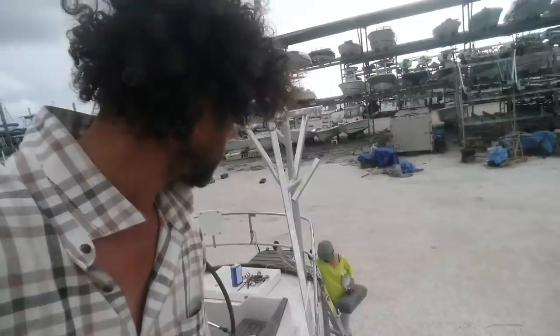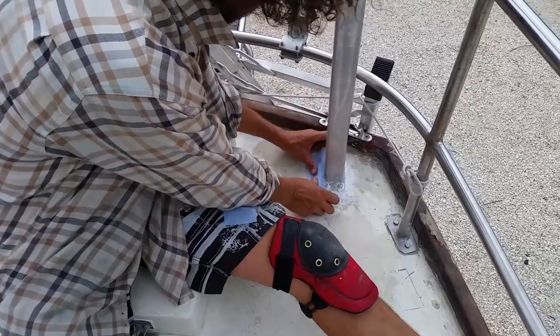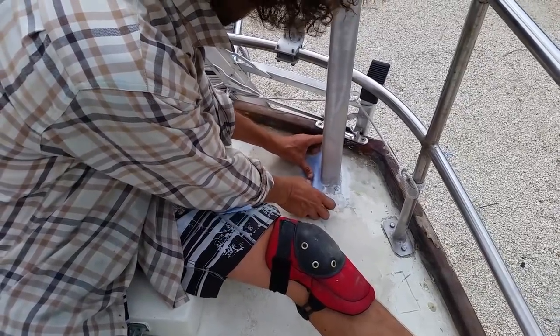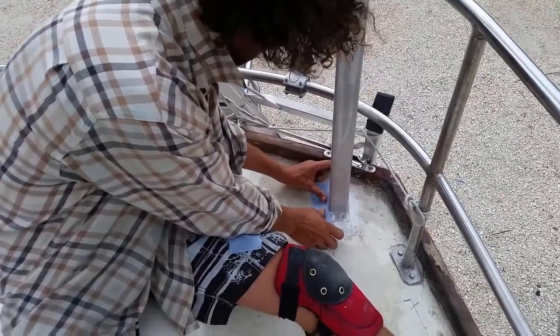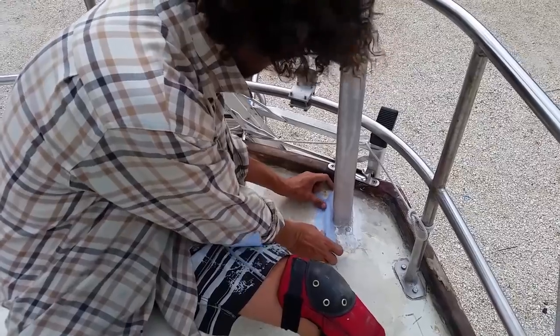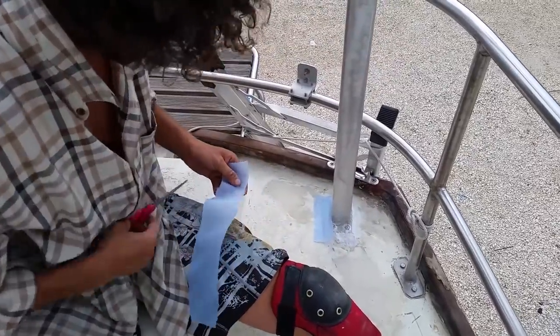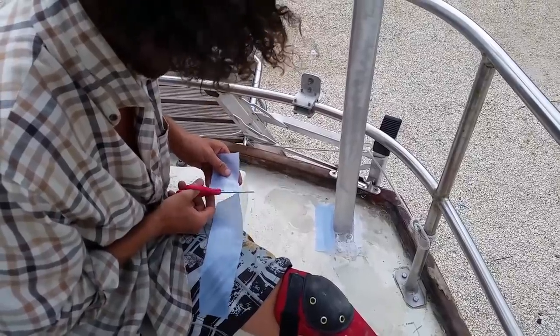Okay. You got all the tools in? And now I'm going to shape the feet just under the davits. And this is where peel ply is bloody unreal. Cut little pieces and then you simply massage the setting resin underneath and it won't stick to your fingers that much and you can get a really good job so the sanding is minimal. So just cut some little pieces and just go around and make it nice.